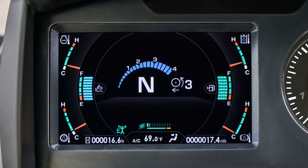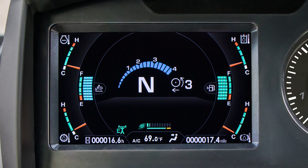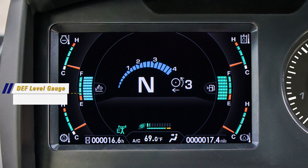The fuel gauge has been relocated to the right center of the monitor and has eight segments that are green to match the fuel level. The display range is 33 to 282 liters, or 8.7 to 75 gallons. At 42 liters (11.1 gallons) or below, the fuel level caution lamp lights up. The diesel exhaust fluid, or DEF, has a level gauge that has been moved to the left corner of the monitor. The DEF gauge has nine blue segments to match the DEF level, 0 to 100%. The red zone starts at 10% and is considered the critical refill range.